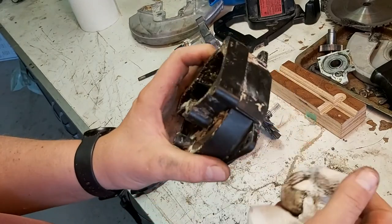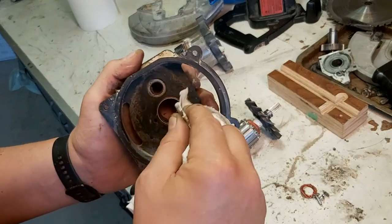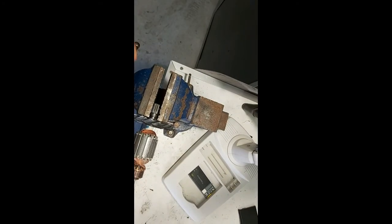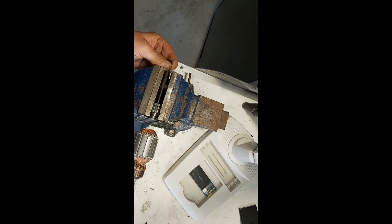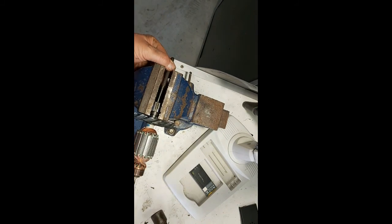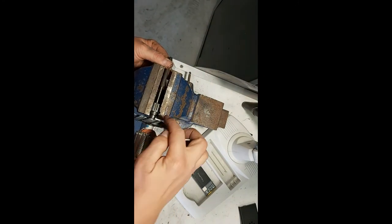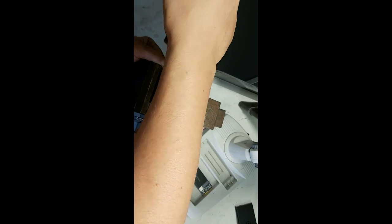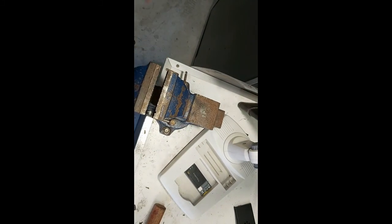I don't know, it's just plastic, but it's a press fit nonetheless. Okay, I'll try to get that out. Okay, I've moved you to another area of Das Lab. I really do not want to break this. I do not want to break the fan because it'll go unbalanced. You're not going to glue something like that together. So just holding that bearing race in the little V parts of the... There we go. And tap it, tap it, tap it. We're out.